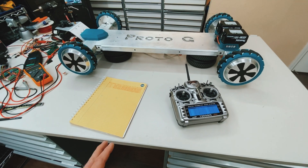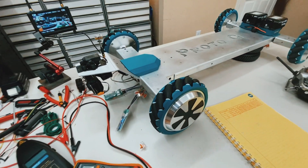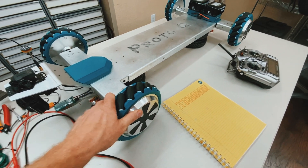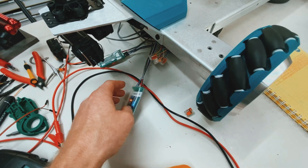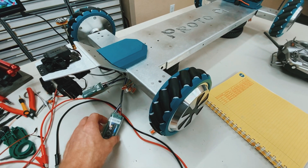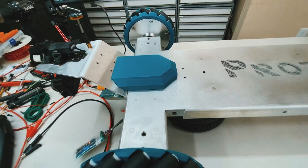I'm not quite sure which I'll prefer, but I'll keep you posted. Before I actually road test this thing, I still need to do a lot of cable management and soldering because right now everything is all exposed. If you haven't been following along, each motor has its own motor driver, and those motor drivers accept a PWM signal. Each motor driver has a microcontroller hooked up to it, and basically what it's doing is converting the output from the receiver and feeding it to the actual motor driver — along with the forward, reverse, and brake pins — all being driven by the microcontrollers. This is the video transmitter antenna, and the RC receiver is in this 3D printed little shell there.